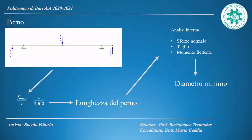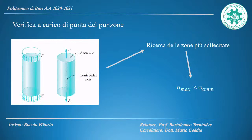The hub pin is subjected only to bending, due to the forces from the tires and the punch force. The design focused first on finding the maximum pin length: by calculating the maximum deflection and imposing equality in the bending check, the length was determined. Static analysis confirmed the most stressed zones; the pin is free from normal stress and subject only to shear and bending moment. Finally, the minimum bending diameter was defined.